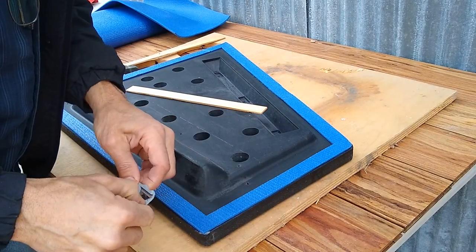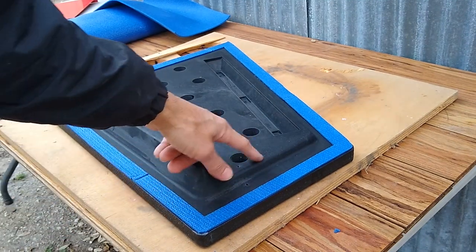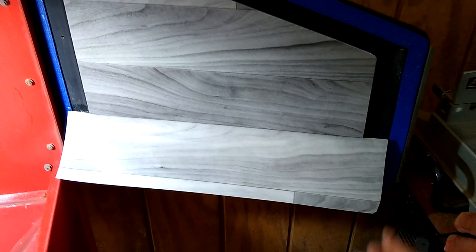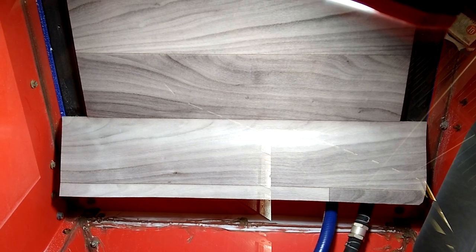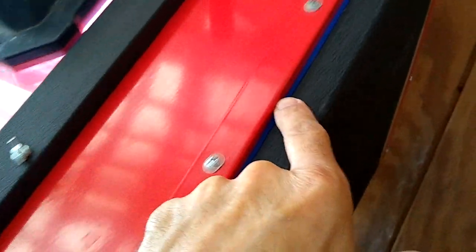If you've got any little bits that need to be trimmed off, now would be a good time. I'm going to have to think about what to do with the area here with the holes — I may pick up on this video tomorrow, but for now we've got the gasket ready to go. This is just a piece of linoleum I picked up on sale at Home Depot. I'm holding it on with some contact cement and it's working really well. This little flap goes on the inside so that when the door is closed and you're blasting, the water that hits the door just rolls right off that skirt.